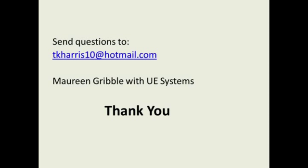Well, the key thing is what we talked about during the whole presentation. I've gone into plants where they're still using drums, and we put filters on the drums to pull the oil from the barrel, run it through a filter, and put it back into the same drum, and try to get them into an area where it's a little bit cooler or a little bit warmer, where it's not exposed to humidity. That could be your first step of putting a lubrication storage room in.